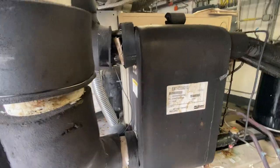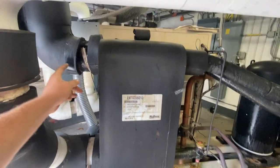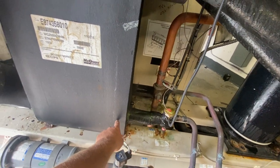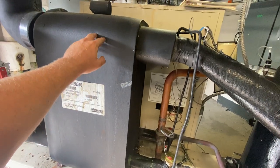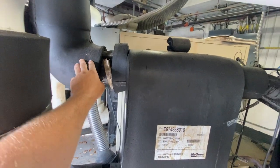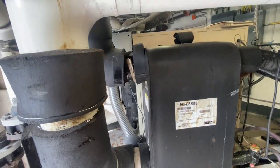Here you got your water out on the bottom and your water in. So your coldest part of the evaporator is going to be the inlet right here. As your refrigerant absorbs heat from the water, the refrigerant is going to start coming back warmer, but it's still cold enough to exchange heat on your warm chilled water coming back.